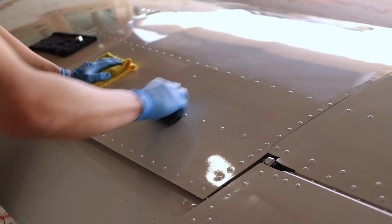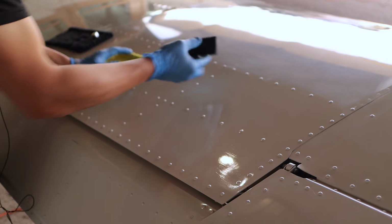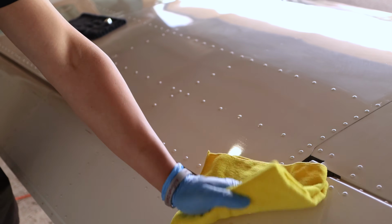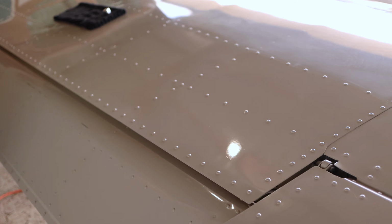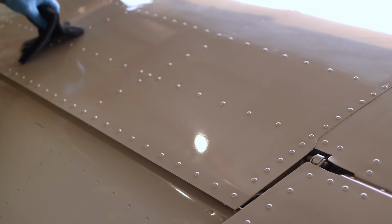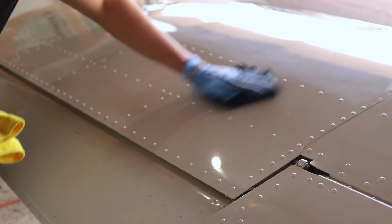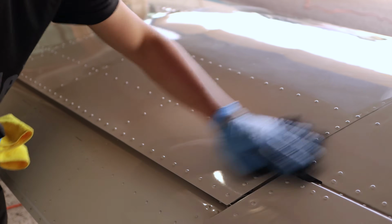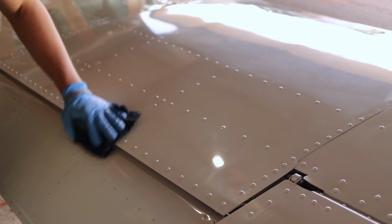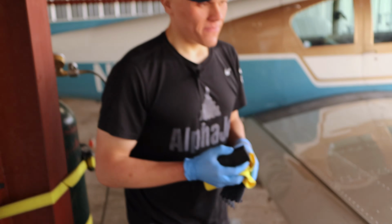And then you cross hatch it. And then you wipe evenly to even off all the surface. And then you wait for it to flash, which is usually about a 20-second process. I can already see it drying. And then you want to take a rag like this and just buff it off. And you keep buffing until you don't feel any lag on the rag and it's perfectly smooth. So yeah, there's that. That's beautiful. Thank you.